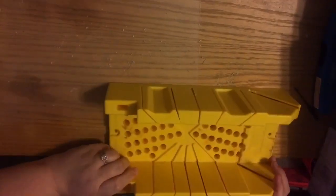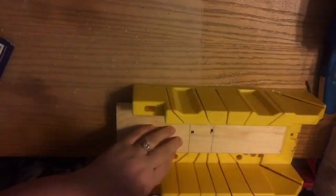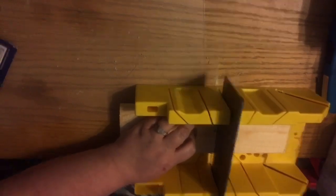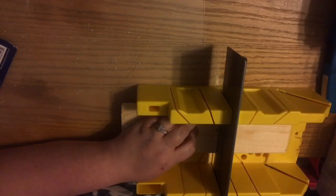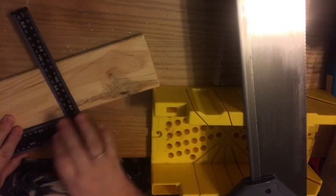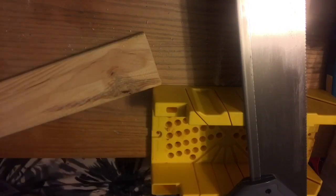Now I'm going to show you how to use the miter box. The miter box has a little lip on it where it goes to the edge of your table, and it has cuts for straight and 45 degrees in both directions. You want to let the saw do its work — my dad always said stop pulling, stop pushing. I believe this is a back saw, which means it actually cuts on the pull. I tend to want to push too because I'm impatient, but it doesn't take that long and it doesn't take much skill or strength to get through wood on a miter box.